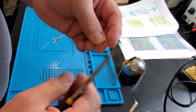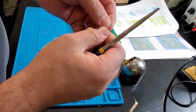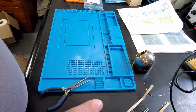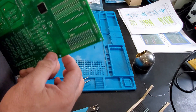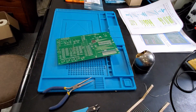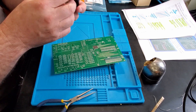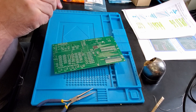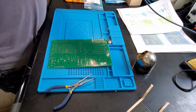I don't usually just bend resistors with my fingers — I'll bend them with a pair of pliers so I get a nice neat row. The problem is if I turn them upside down, even with the leads bent back, inevitably one or two will move out of position. To prevent that, I'm just going to put a little strip of tape along there. I normally use blue painter's tape but this electrical tape is about 20 years old, so it's getting used for this.